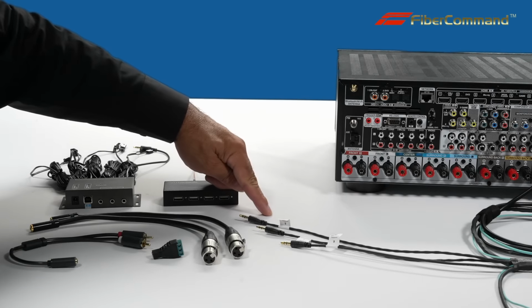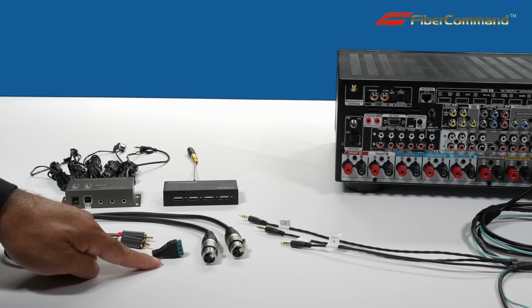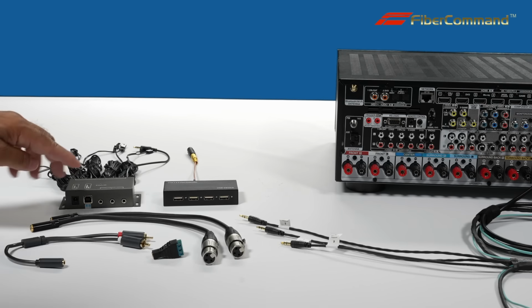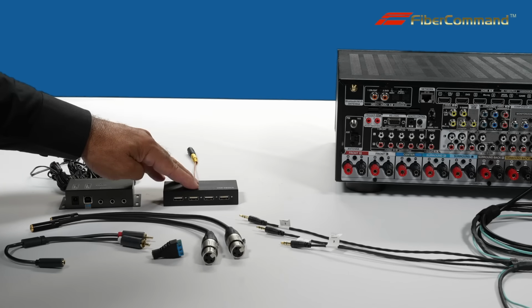But there's more. The Fibercommand Pro triple digital links can connect any combination of XLR adapters for analog or digital and bidirectional audio, low or high-speed serial RS-232 or 485 as well as triggers or GPI or custom dual signals over screw terminals, RCA for analog or digital and bidirectional audio, smart home hubs or infrared remote hubs to control hidden devices from the room using adhesive control repeater eyes, and as an absolute zero-lag USB extender to control computers or gaming from the room.